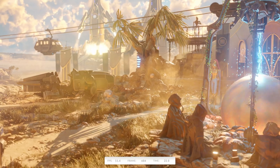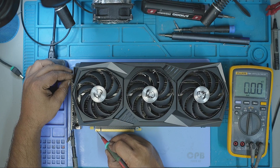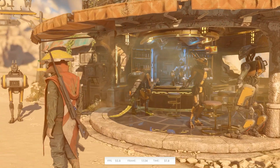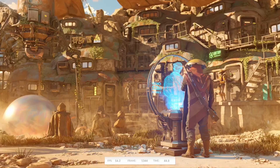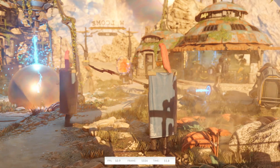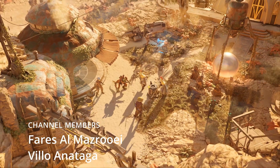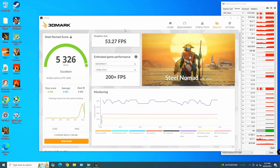To sum it up, this RTX 3090 had two major short circuits — one on the 8-pin rail and one on the PCIe side. After tracing and removing the shorted MOSFETs, rebuilding the power stage and replacing the fuse, the card is now fully functional and stress tested. If you found this repair helpful, give it a thumbs up. Consider subscribing and turning on notifications. You can also support the channel using the thanks button or by becoming a member for exclusive content. And if you've got a GPU that's dead or acting weird, head over to gpusolutions.net to book your repair. I take on challenges like this from around the world. Thank you for watching and I'll see you in my next video.